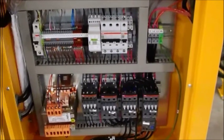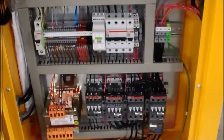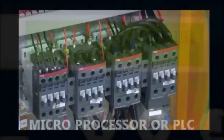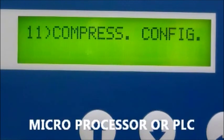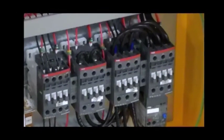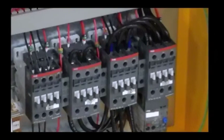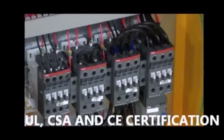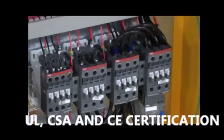If we move over a little bit, we can learn more about the energy-saving master brand ABB Y-Delta soft-start contactors equipped with adjustable thermal overload motor protection. Through the microprocessor, or PLC, an electronic signal is sent to the contactor, activating the drive motor startup in time phases, which reduces startup amp-draw by lowering impact on peak demand by one-third. This function is commonly known as soft-start. Also, the contactors meet UL, CSA, and CE certification requirements.